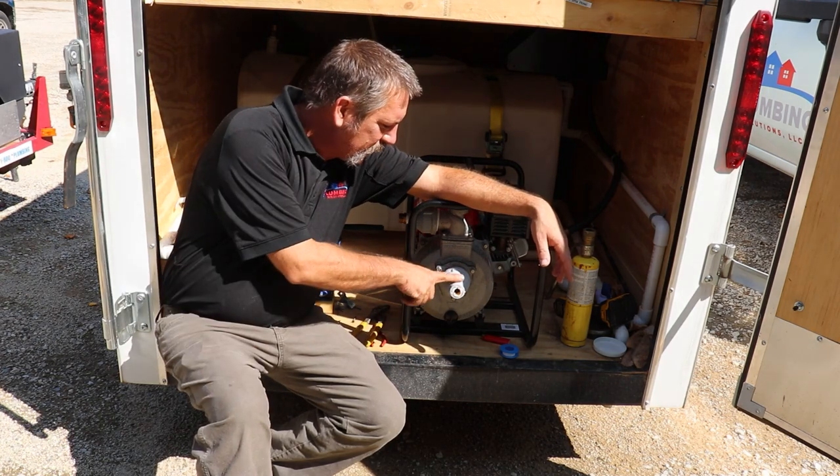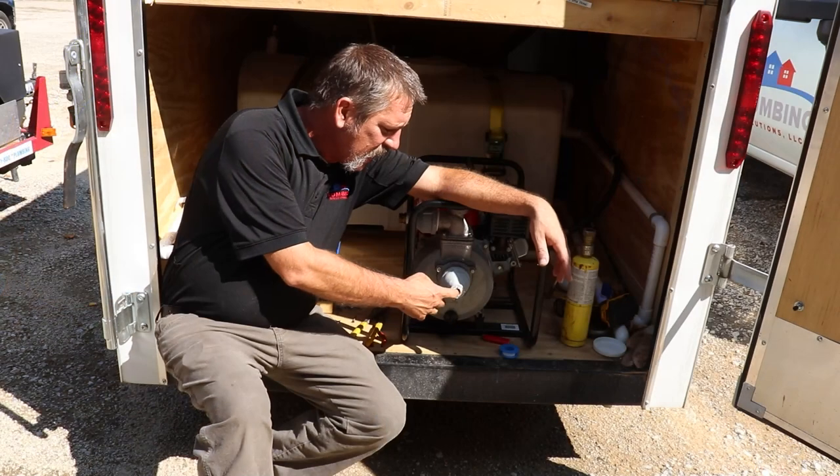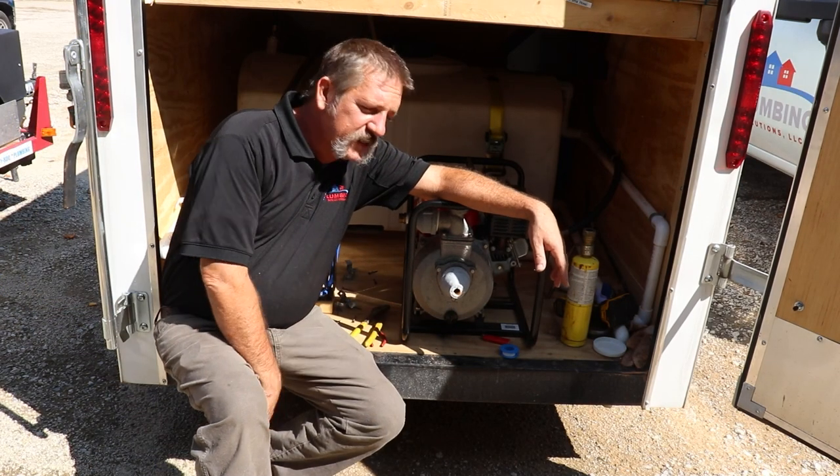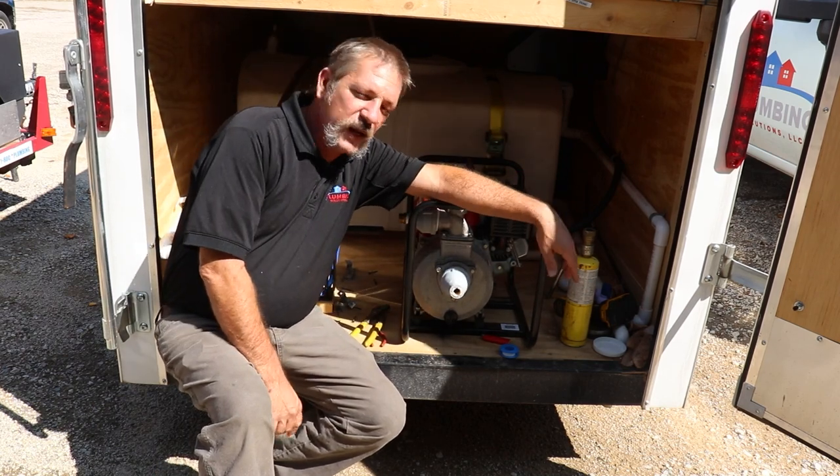A fitting broke on my pump here. I got a galvanized bell coupling here to transition it down to three-quarter, and I used one of these little plastic three-quarter fittings to make my attachment here.